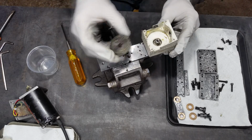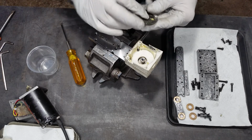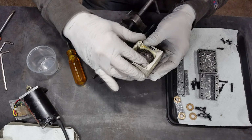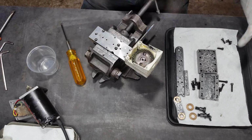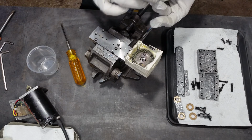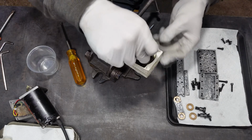It's held in place with the 2 screws you just saw me do. There are 2 more I'll do later on. I think this is a tapered bevel gear. I'm not really sure. It came out of an angle grinder. It had a keyway drive on it, which I've replicated, and then it all gets drawn together with a center bolt under the shoulder there.